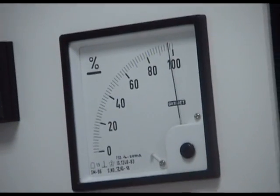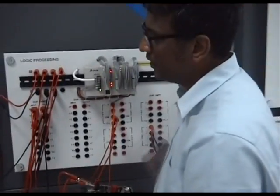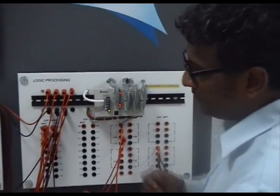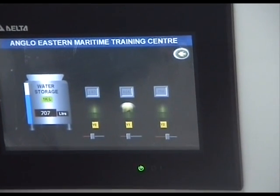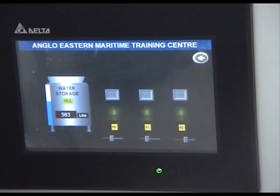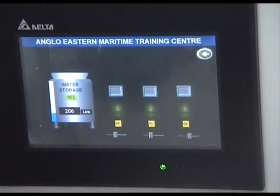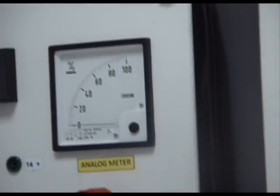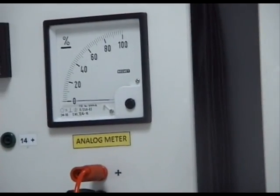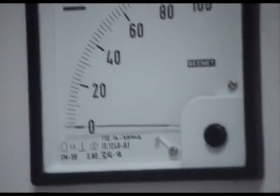That's exactly 20mA and we have perfect calibration of the analog input. Calibration of the analog input is a function of programming the HMI and scaling the raw data it receives — in this case a 4 to 20mA signal through an interface. To complete the demonstration I'll bring the water level down — Y2 will come off first, then Y1, and eventually as the tank level comes down further we will have a low level alarm. At 4mA we get roughly 0 liters — bang on target. This system is perfectly calibrated, with the PLC manipulating analog data to give digital output indication.